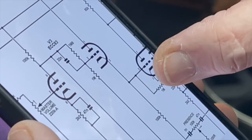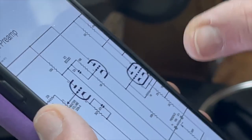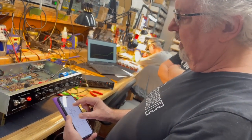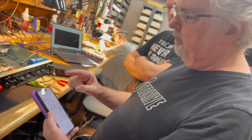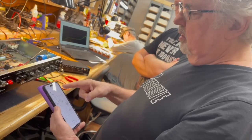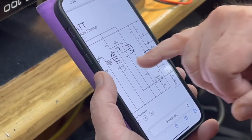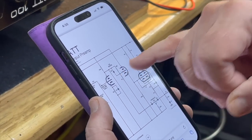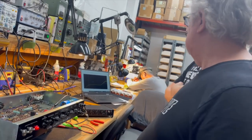That doesn't really affect the low frequency response much, but we are getting a low frequency behavior change by having done that. It's very subtle, but that could be because those resistors in series are adding a little bit of an additional load on that tube. That could affect the low frequency behavior. But the biggest part of the behavior is that the high frequency emphasis is reduced practically by half because of this resistor value change. And that's showing up exactly on there. So now let's listen.